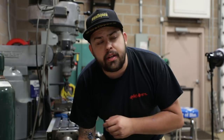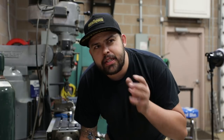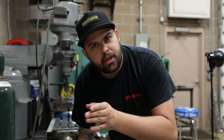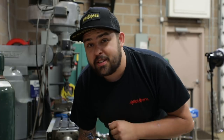And you know, I practiced and watched the videos and watched everybody say, feed filler rod while you're watching TV. And I think that did help, but it didn't really teach me. It was more, I just needed to do it. And I used to struggle so much with feeding filler rod on steel. I just felt like the whole process, steel versus aluminum, steel was so much slower. Now, on aluminum, I could feed filler rod all day long because basically I was just pounding rod into the puddle. But when it came to steel, I felt like I wouldn't be as consistent as I would on aluminum because it's just so much of a slower process. And steel doesn't consume filler rod as fast as aluminum does.